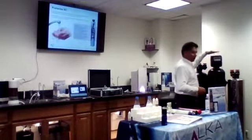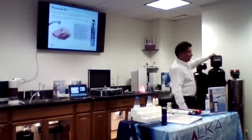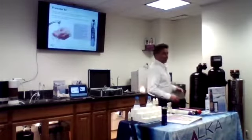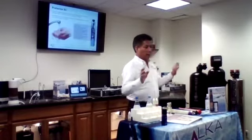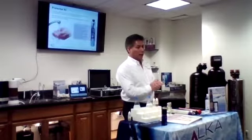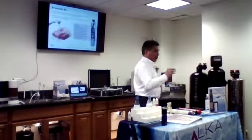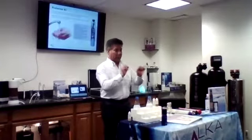Because eventually this head will break, because it's working every day. You want to use a system that is going to regenerate once a week. The max will be twice a week. You don't want to regenerate every day. So that's why it's important to know how many people are in the house, all the details.